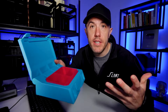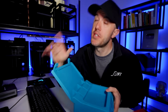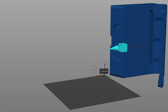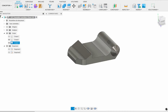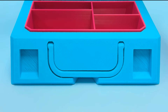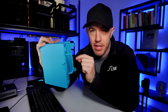With the ability to print on demand, it's really important to design it so it can be printed all in one shot. Most people would say lay it flat with the lid over here and the lock over here — but that means multiple parts and problems with bed adhesion. The next thought is to put it on its side, but that's not correct either. The issue is you would not have reliable latches — these latches have small spines through the middle so they can rotate, but if you want them strong and reliable, you cannot have layer lines going up the inner edge because they would snap right off. You also have this small thin handle, so printing on its side would be unreliable — the layer lines would be right there and it would snap right off.